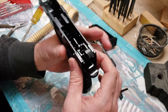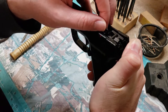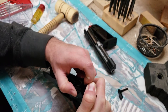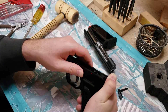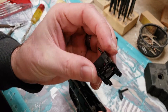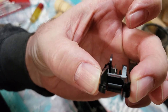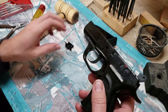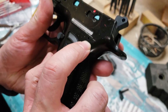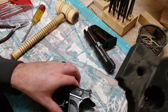I have the safety out now, so I'm gonna set it down. Now I should be able to cock the hammer and get the sear cage out — you can see it's starting to lift right there. There it goes; it just kind of jumped out of there. You can see the spring is still captured, sticking up really well right there. Now the sear cage is out. You just have to drift out that roll pin right there, put it on the block and drift it out, and then we'll be able to get our hammer out.